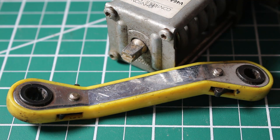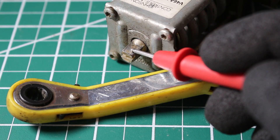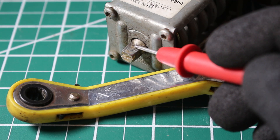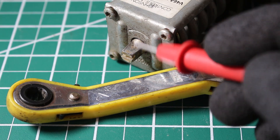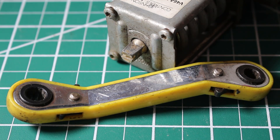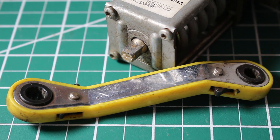To adjust your water regulating valve, you're going to either turn the stem clockwise or counterclockwise, depending on where you want your system to be at. As we adjust this, we adjust the water flow and the head pressure in our system. To make the adjustment, we could use a flathead screwdriver, but I would recommend a refrigeration wrench or a ratcheting wrench — those are always the best to make your life easier.